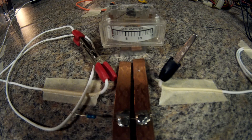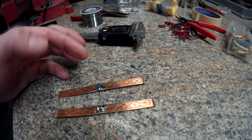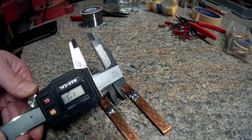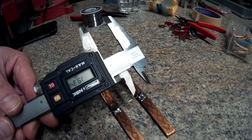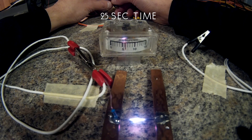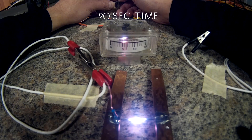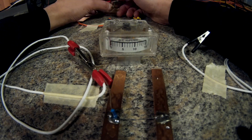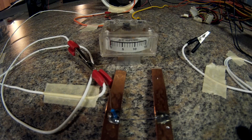So I will unsolder this and solder a new one in with a wider gap. I started with a brand new resistor here and tried to solder the edges to get an accurate distance. That's a distance of 19.34 millimeters. Contact. So if your fuse length is longer, it'll burst quicker. And that's holding at 6 amps... 6.5... and she's gone. So 6.5 amps on a wider — what was that — 19.3 something millimeters.